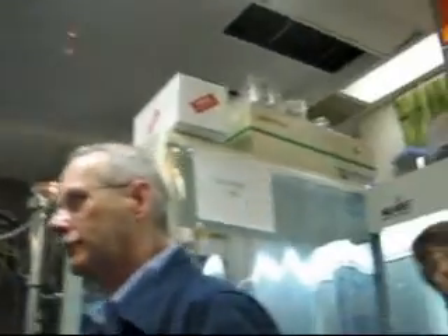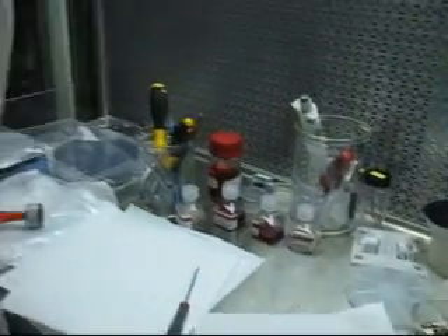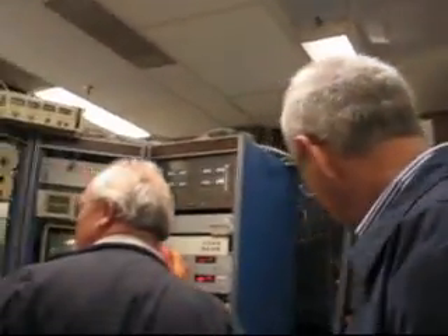We process a huge variety of things — everything from basic physics research on nanowires to other applications. It's nice that I can get almost a half-millimeter field on this, so you have less field stitching, while on that tool you can get maybe 200 micron fields. Stitching on both tools is similar. As Hank would tell you, we have a scheme called spatial phase-locked lithography, where we put a fiducial grid down in the substrate to get much better pattern placement than most tools, accounting for beam drift, thermal drift, and long-term drift.